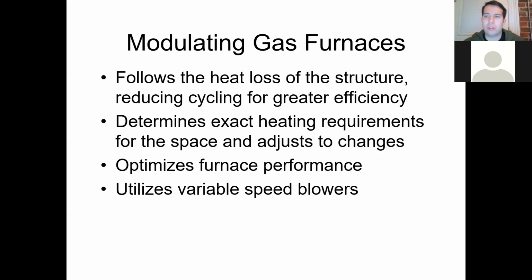And then they've got other ones where it might not even need an outdoor temperature sensor. It might just hook up to the Wi-Fi, put on AccuWeather, and see the 7-day forecast and get ready 7 days ahead of time to adjust how much heat it needs to produce just because it knows what's coming. And the other thing with these, when they have memory for them, it'll build memory and it will learn. If it's got a house that might be a little draftier than what it was originally designed for, it will adjust itself for that.